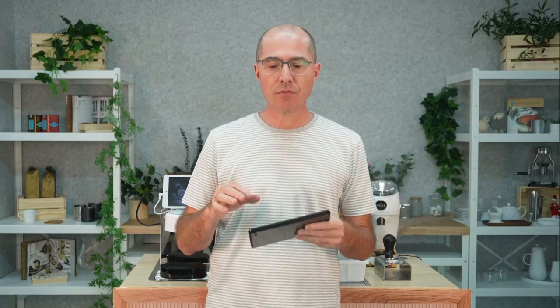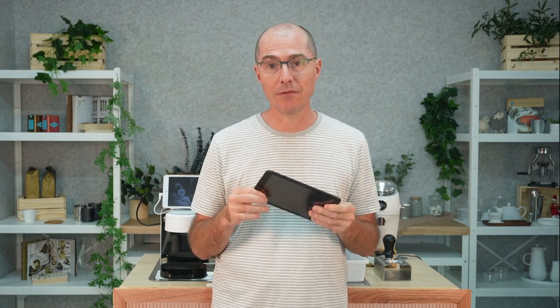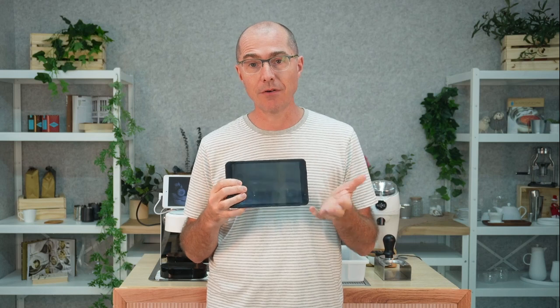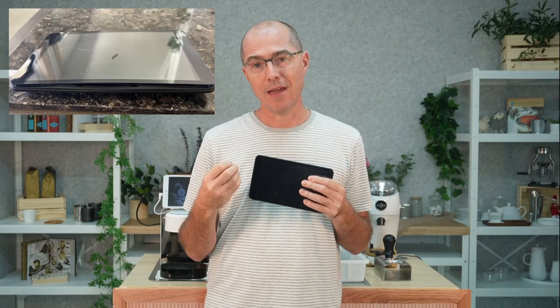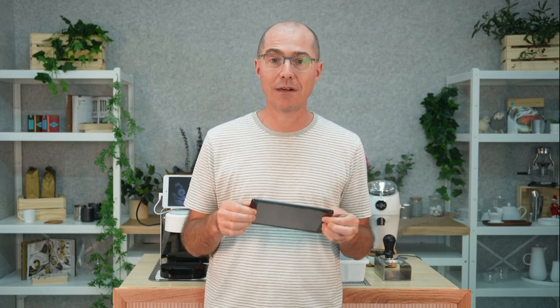In this video, I'm going to talk about how to replace the battery inside an Android tablet with a power supply. There are a bunch of reasons why you'd want to do that. The first is that if you are using a tablet or some other device like a phone and it's always on, it might swell the battery with age. This is particularly a problem with Android — the Android operating system still doesn't have smart charging. Samsung devices do, but Android's global OS does not. Without smart charging, any Android device that's plugged in all the time is going to have a battery that degrades kind of quickly.